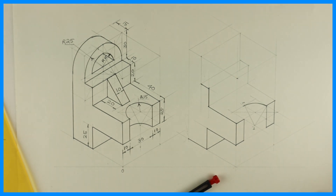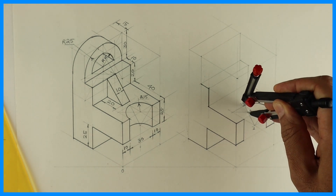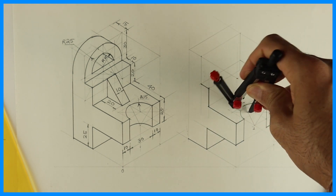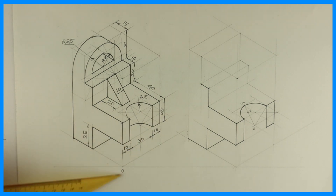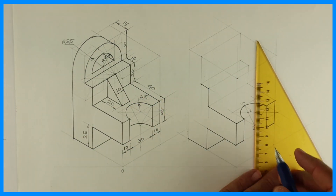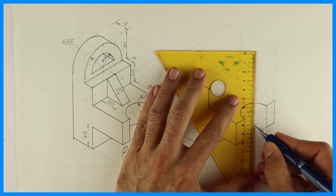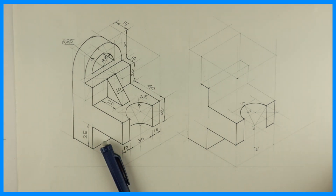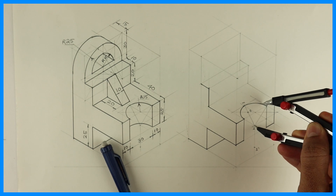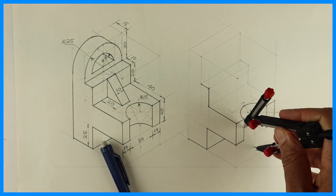From 1 to M you can draw an arc. Then again from this point, that is 2, from 2 to M you draw another arc. Then you take this point down by 25 — this is 1 dash. Then you take the same radius. It's called the copy-paste method: you take the radius, go down, and again draw the same radius.